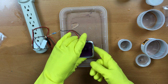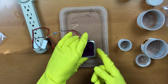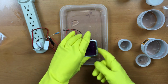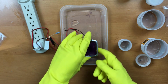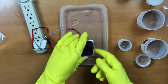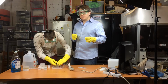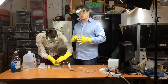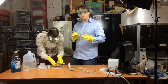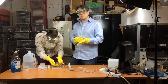Cobalt is used in steel, like if you've heard of cobalt steel, that's used for things like drill bits or cutting instruments. It's one of the elements that's put into steel to make it really hard, and you can also use it for gold. The gold itself, it's like 99% gold on there, maybe far less than 1% cobalt that's in there. The gold itself that's dissolved in there is atomically dissolved gold that's floating around in solution. And gold is really difficult to dissolve, so it uses some very harsh chemicals to get it to dissolve in solution. And by running the electricity through it, you are taking the gold plus atoms that are floating around in solution and putting an electron on them, and then they deposit onto the surface of the steel.